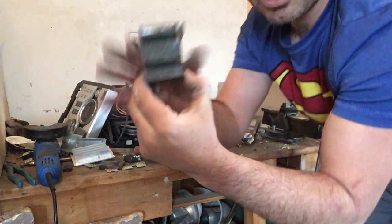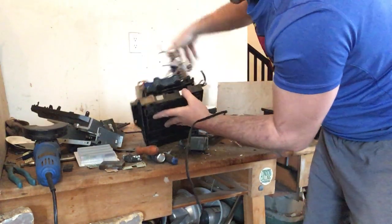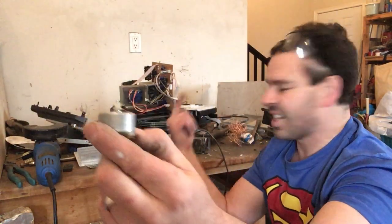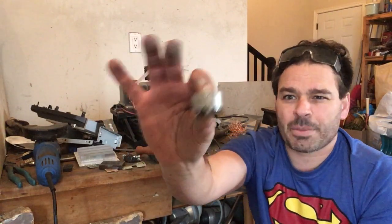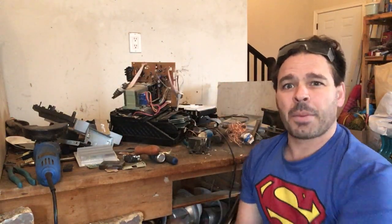I'm going to probably have almost a pound of copper in this, and I have tons of tin now. Some of them will also have a couple of small motors inside — these motors turn the discs and the CD changer. I will just throw those into my copper bearing motors bin and get 15 to 20 cents a pound for those. With the larger transformer here, I'm probably going to get a pound and a half to two pounds of copper. Definitely better than passing it up, definitely better than bringing it in whole and getting electronic weight price. Very easy to take apart, so definitely don't pass those up.